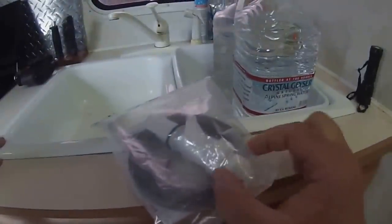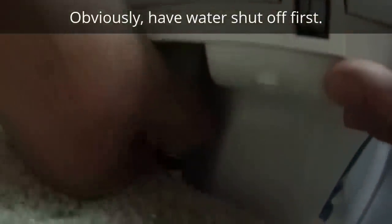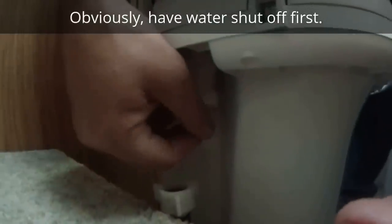What I'm going to be feeling back here is the water line that goes up to this piece right here — that's what I'm going to disconnect. Now I'm reaching for the wing nut. This is the water supply line here, everybody. Okay, I got it. Now the toilet should lift up.